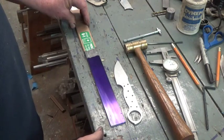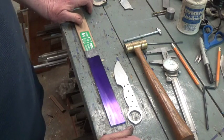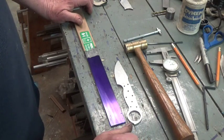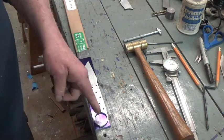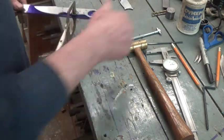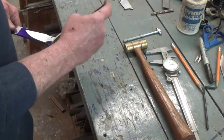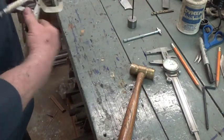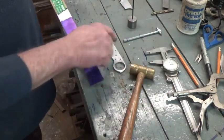I'm going to put together maybe two videos of this build for him, showing a little bit of each and every step, including taking you over to the mill to show making the large hole. Now that the dykem is dry, I'm going to clamp this down. The very first step on a knife like this is always this hole — that happens first, and then the rest of the knife is laid out around that hole. I use a one-inch transfer punch guide and then an eighth-inch transfer punch down through the hole and strike it. Now the hole is located.